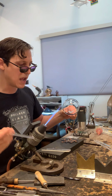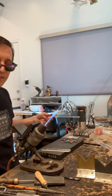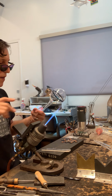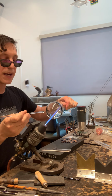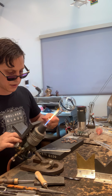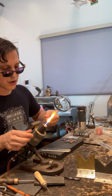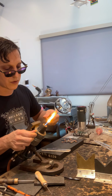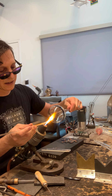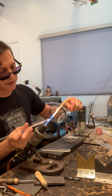Okay? And then you can grab it with a variety of pairs of grabbers. These are great. You can hold on to it for a minute, and that's fine. Or you can attach a handle to the bottom, and that's a nice, safe way to do it. Of course, you can get cracks if you take too long making your hook. You want to go back and reheat this to remove it carefully, sometimes heating it a little further down the rod and then picking away at it until you have none left.